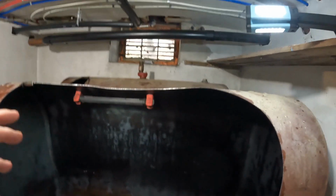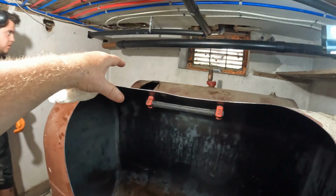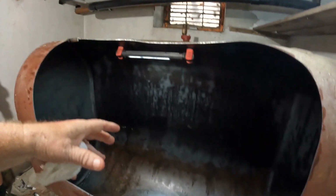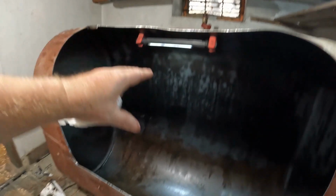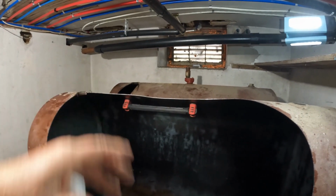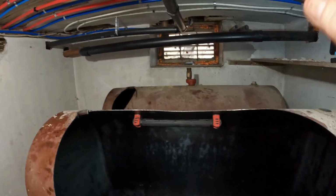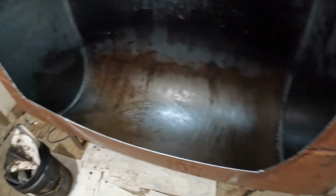So we've noticed in the past that the only oil that gets in here, because nobody comes and fills up 550 gallons in two 275s, they let it run to half down, so it'll only take 100 to 200 gallons. So we've noticed that the tank that takes the fill has more sludge, or the sludge situation is worse than the first tank. So you obviously saw how clean that was. It wasn't even half a bucket.